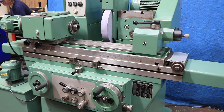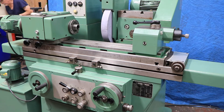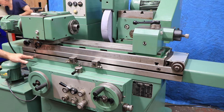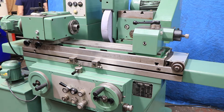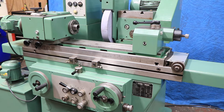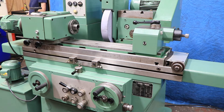This machine is currently wired for 220 volts three-phase. We had this machine here in the shop and did a lot of work to it because we liked it. This was scraped originally in Switzerland — it's a Swiss machine from 1980. We determined it would be best if we had the ways on it re-scraped. That means the surfaces on the base of the machine — the flat and the V for the longitudinal slide, and the flat and V for your cross slide, as well as its matching slide on top. This has all been re-scraped by a very reputable machine tool rebuilder in the area. There are a lot of things that make this a high-precision machine — not just the scraping, but the whole package: the way it was built and the rigidity of the machine. Most people are very happy with them.